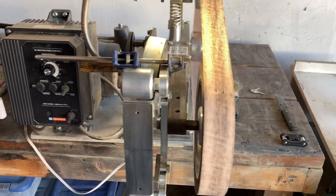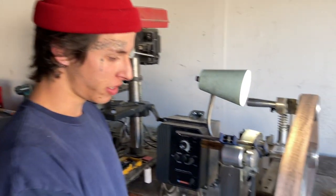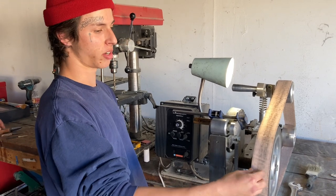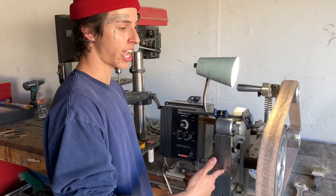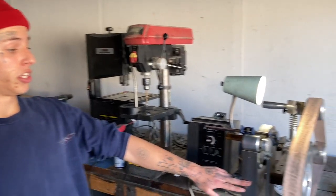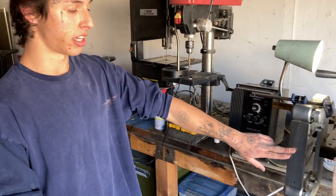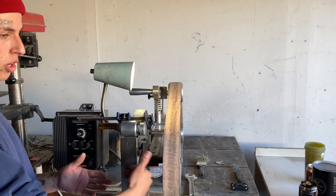I've never done a hollow at all, so I may come up here and borrow your setup. When you're grinding it, it feels like a puzzle piece — you get it to the proper depth and it just locks in, just sinks in. So it's easier to control the grind. With a flat you're kind of going off sight more. But it's getting that without all the facets. Using eighth-inch stock, which is mostly what I use, it's harder to feel it out that way. If you're using three-sixteenths you have more to work with.